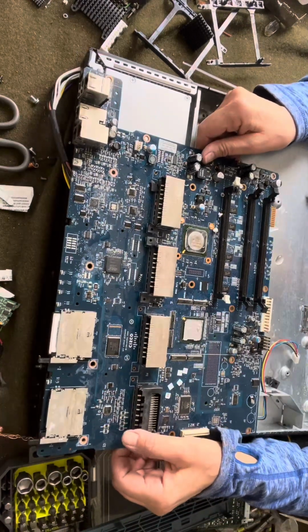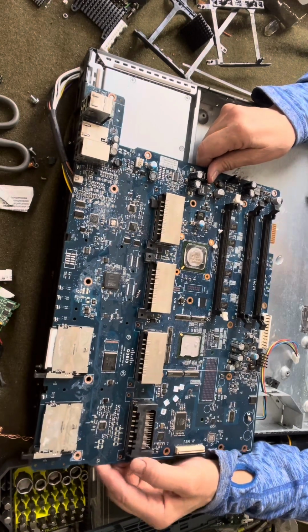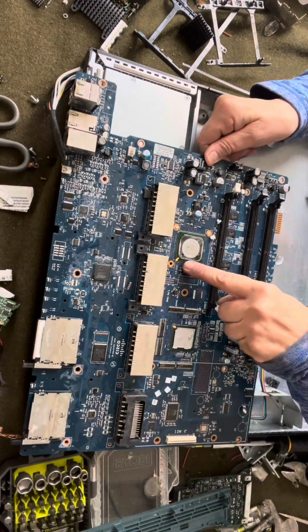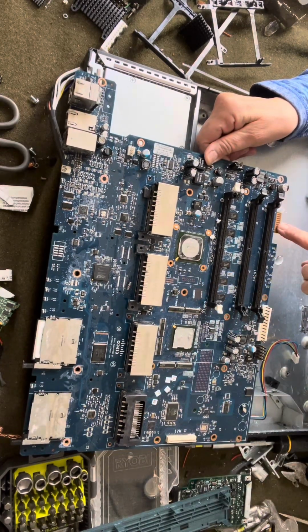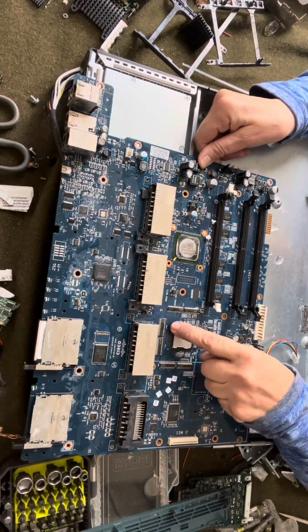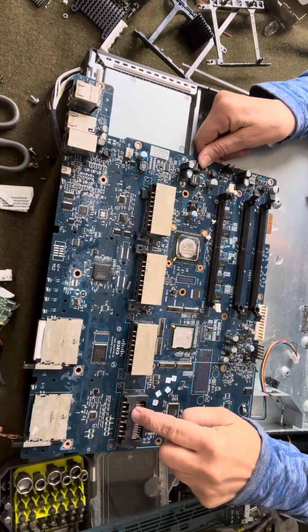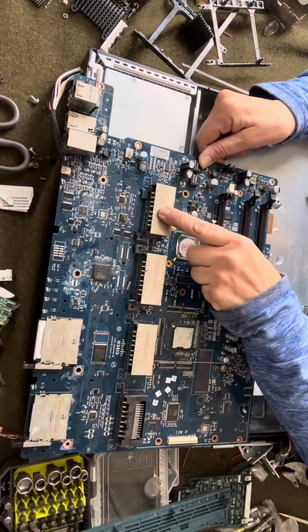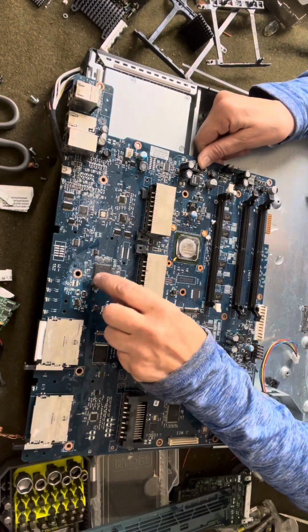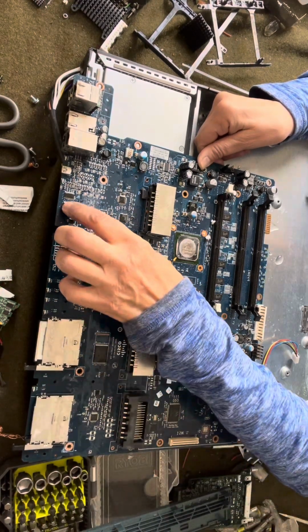Let's take a look at the board itself. To go as a high-grade telecom, it must be fairly densely populated with visible gold and good chips. I've got visible gold, I've got visible gold, I've got good quality gold-edged BGA chips. I know there's gold in here. There's gold here on the flashing. I have more gold-banded BGAs right here. I have flat packs. I have IC chips.